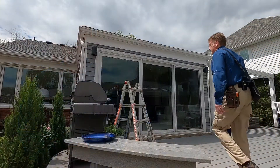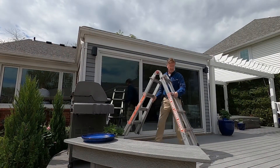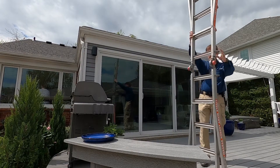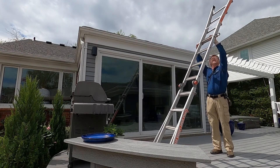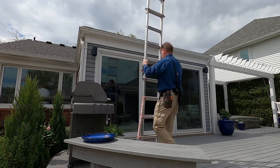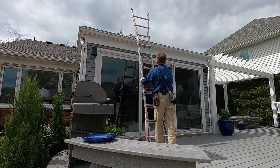The roof inspection usually begins from the ground. A safety-conscious home inspector will always look for structural irregularities prior to stepping on the roof. If you see any reason not to traverse the roof, then don't. Most standards of practice give the home inspector full discretion for determining what's safe or what won't cause damage. And while you're up there, remember not to take any step for granted — continually maintain awareness of every single footfall.